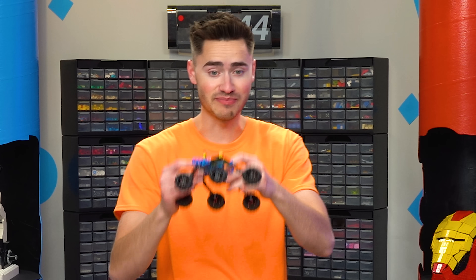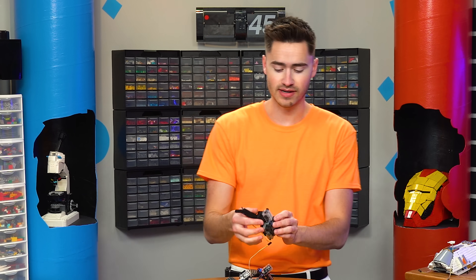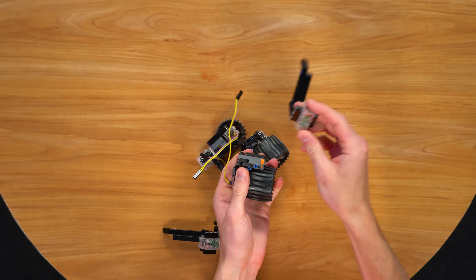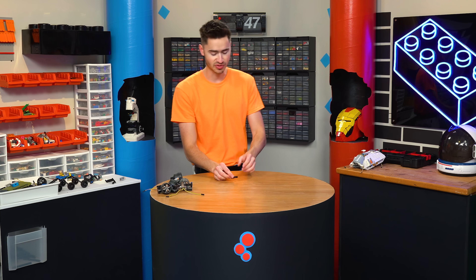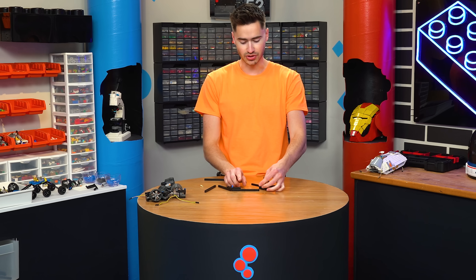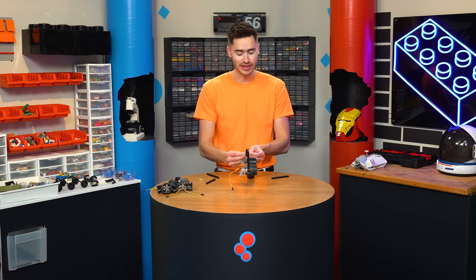This is just a prototype though, so we need to actually build it onto our rover — which means first we've got to detach our current wheels. After seeing the difference in steering and strafing in our last test, I've realized since we can rotate perfectly in place without moving, there's really no reason to have the extra motor on each wheel just to strafe. We can just turn it like a tank and get basically the same result. We just need to copy this design and build two large linkages to hold our motors and wheels.